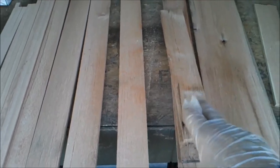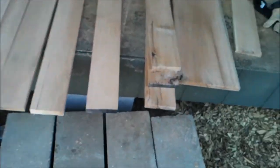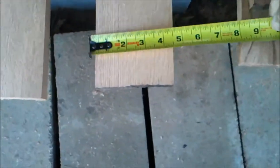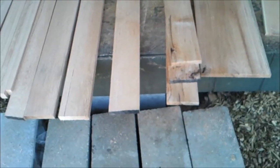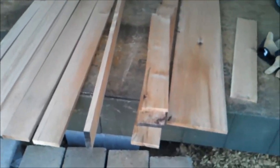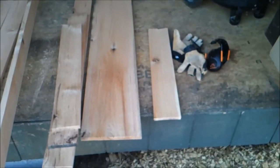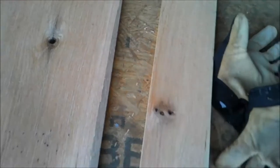So I'm going to start cutting all of these pieces — those four pieces out of these — then I'm going to start on those. Whatever scrap I have remaining, we have just a little over four inches here, about four and a quarter. So I think I can get two pieces that are two inches wide. This is all seven-eighths — I left it thick; I want it thick and bulky and strong. Then of course we have this half-inch piece, and it went down cleanly to a half. I've got twice as much as I need there — I only think I need about a ten-inch piece, two inches wide. So there's one for one of the lever arms and some for the other lever arms.